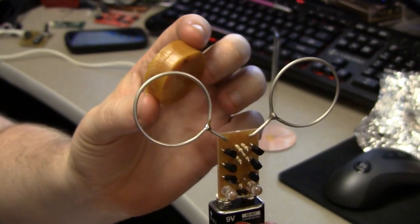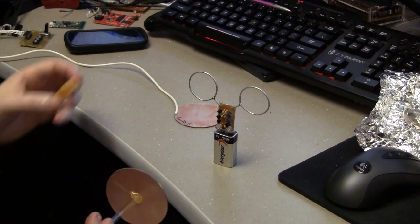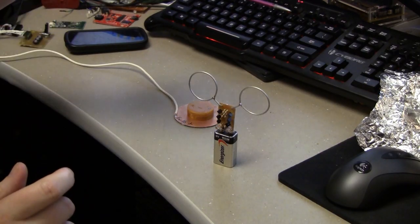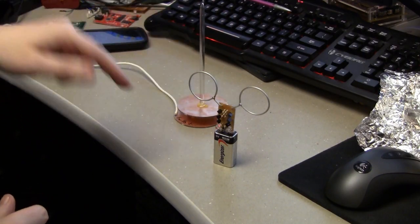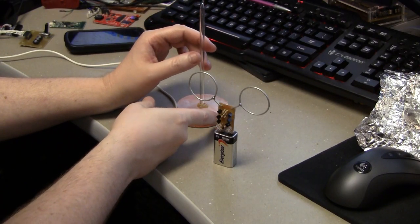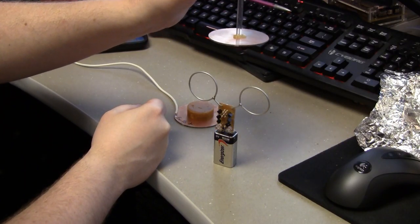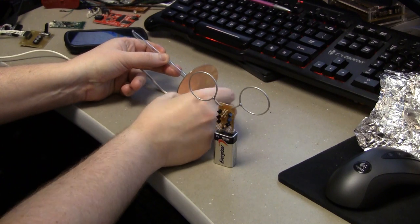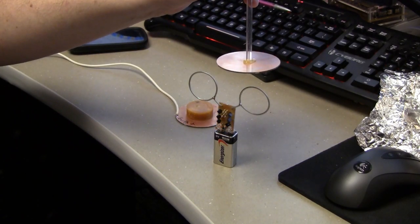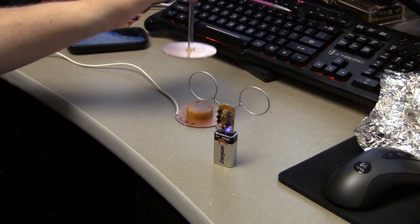This particular electric field is well known for going through a polarity reversal 24 to 48 hours after being created — but for our purposes, this will work fine. We can create a kind of infinite electrophorus here. If I put it on the earth plate, you may have seen electrophorus before where you charge up something and transfer the charge by induction to a metal plate. So if I put the metal plate on top of the electret, it pushes the electrons into my finger when I touch it, and now I've charged the plate. Flipping the electret over and repeating will light the opposite LED — a pretty good indication that this is actually an electret and it's working quite well.